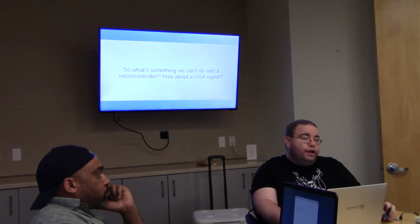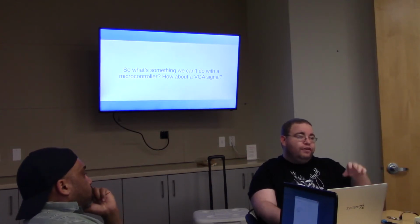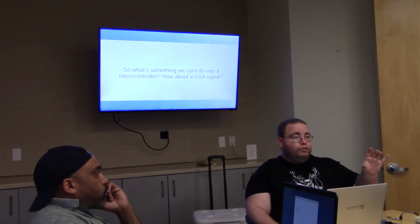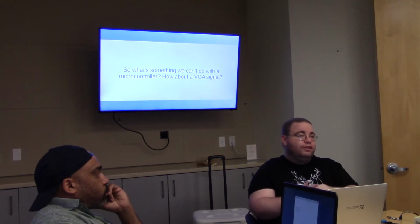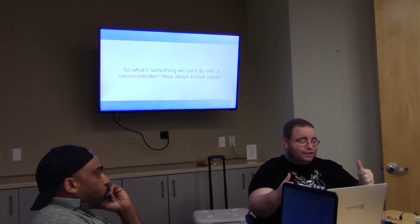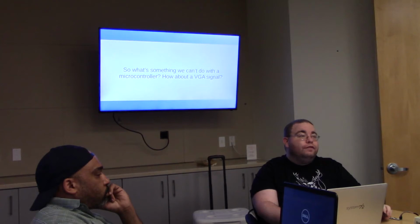I started looking at what I was going to do for video, and I found the perfect chip for it. It had a bunch of registers you could talk to, you could tie it to the bus, you could write values to these registers, and they controlled things like what sprite number 3 looked like, what the background color of sprite 2 was, the position of these things, and so on. All you've got to do is set these registers, and it just generates an NTSC signal that you plug into a TV, and it'll show these different colored things moving around the screen. It was great. It was called the Commodore VIC, video interface chip.